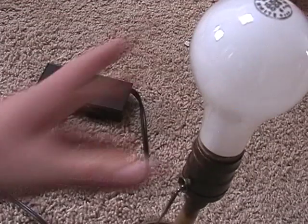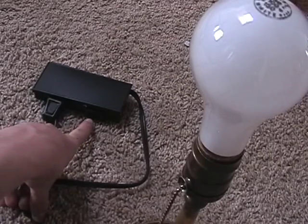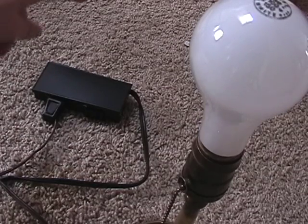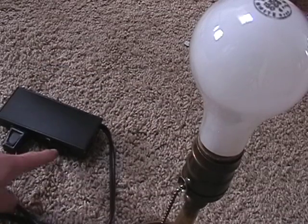It has three modes but I only have one mode outlet, so it's either 100 or 150 watts. The bulb will usually not turn on if your load is not drawing more than 150 watts. For instance, I'm repairing an amp that draws 70 to 75 watts, so under normal conditions the power will just go through the light without lighting it up and out to the amp.